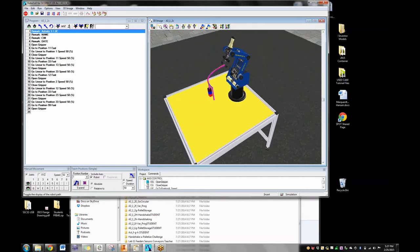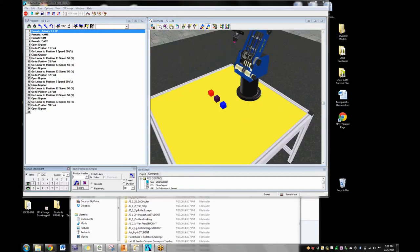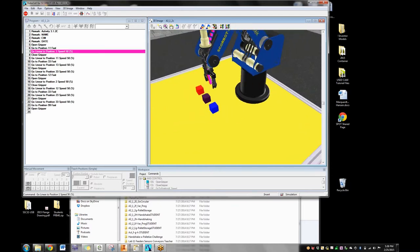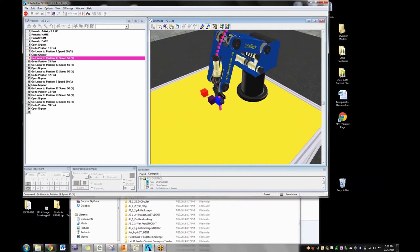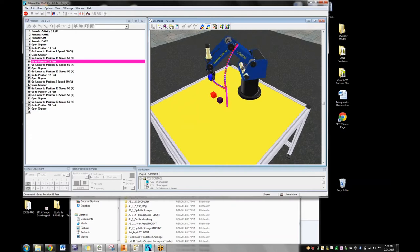The trails can be turned on and off. Before you can do anything, reset the WorkCell — that sets it back to normal. Now I've got my first chiclet and can run a single cycle. Every single time you hit reset, it's going to go back to the view you had set up in Cell Setup, but that can be manipulated. If you like the current view, near where it says 'show robot path' there's an old camcorder icon — if you hit that, it'll save that specific view, so every time you hit reset it won't flip around.